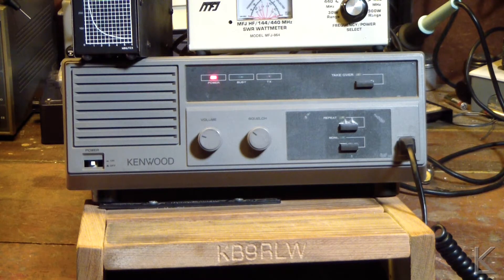So I figured I'm just going to do a teardown video on this. Let's open it up and see what's inside a Kenwood commercial unit. Most commercial units are usually built to be easily field serviceable, which means they modularize them so you can replace the transmitter, receiver, power supply, or duplexer as a unit easily and quickly.